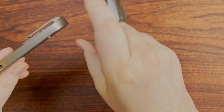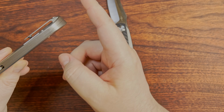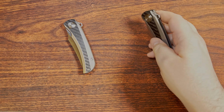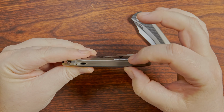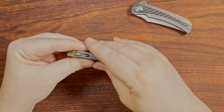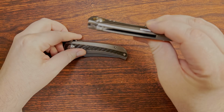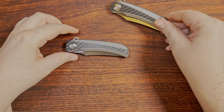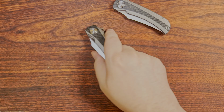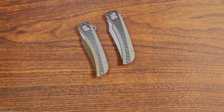Between the two, I'm always kind of a fan of this clamshell construction, but I do understand, yes, it is more expensive. You have to start with thicker pieces and do a lot more milling on these guys than you would have to do on these flat slab guys. So yeah, there's a lot more work and machine time that probably went into that one.